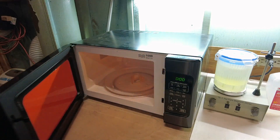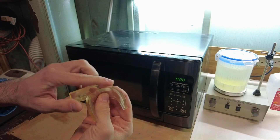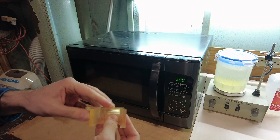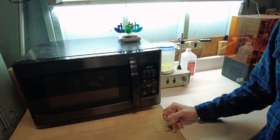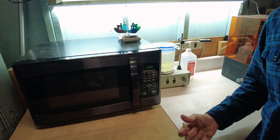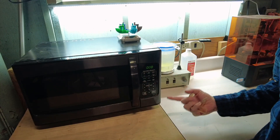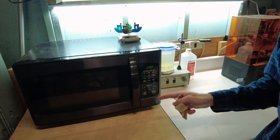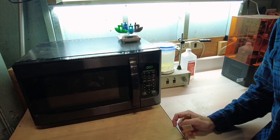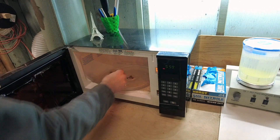Alright, so this has been going in the isopropanol for about 20 minutes or so. I'll go ahead and pull it out — that seems pretty good. I'm going to give it a little blow dry with my cordless electric blow gun — super handy little thing to have. Now let's go pop it into our freshly made UV curing station. I'm going to put it in for 20 minutes. And now we wait. Alright, let's see how it did. Wow — looks just about perfect to me. Nice and dry and perfectly cured, hard as a rock. That's basically all there is to it: the Super Cure-O-Matic, made out of a cheap UV light and a free microwave. I'm interested to hear if anybody has any ideas on how to improve this design. I love reading people's comments about how I can make stuff better. If you make one of these yourself, I want to see it — send me a picture, send me a video. Until next time, see you later.